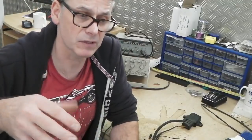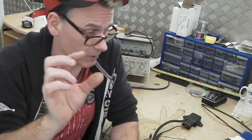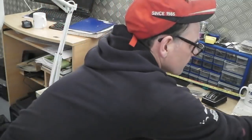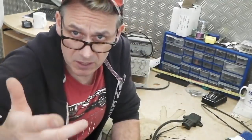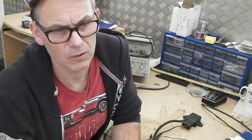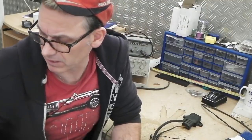Again, there's some extra things in there, there's some 4 center clocks to do. They just want the innards putting in. Here they are. Over here, these need building up. They need center pods, fuel gauge, temperature gauge, amp gauge, and oil pressure gauge fitting in, and then testing into the wiring harness warning lamps. But it's all coming to a close here now on this electronics build.